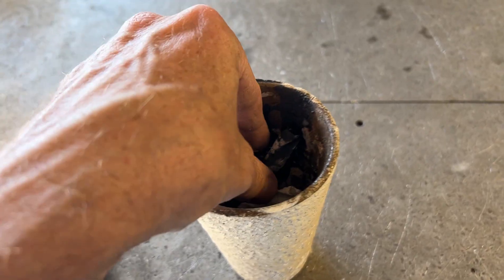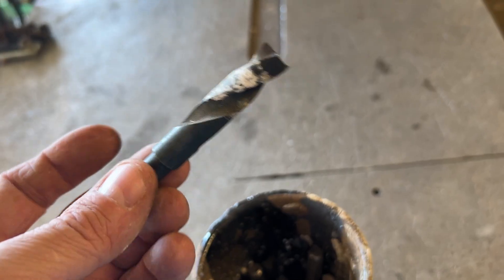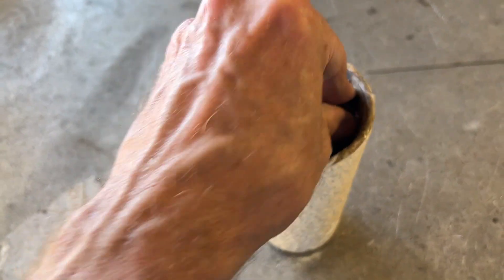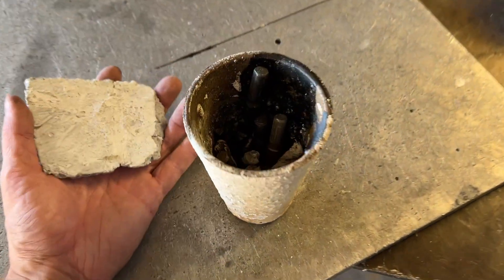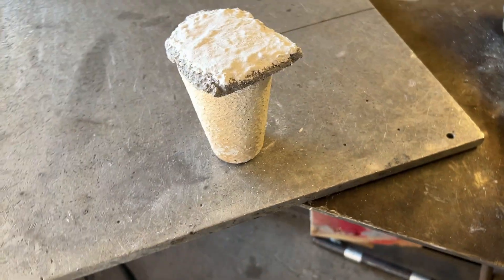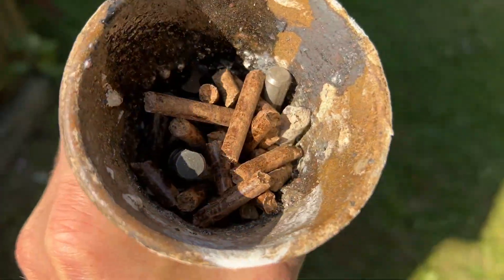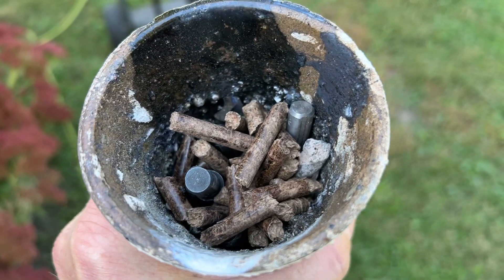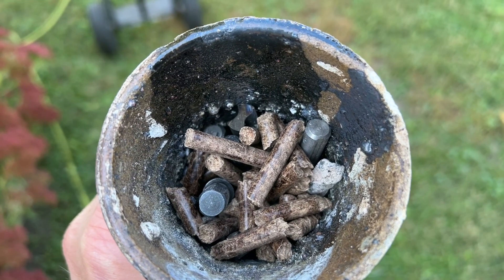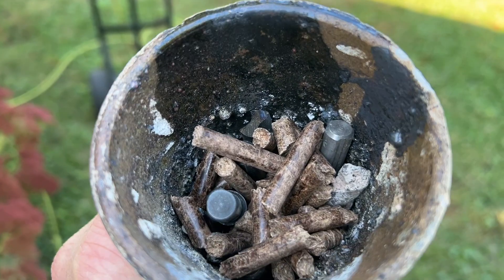Alright, we got 336 grams of some drill bits that I've cut in half, which are still hot. So if we can melt these without oxygen, we're really doing something. I'm going to put this crucible lid on top of it also. I put some wood chips in here — they're going to turn into charcoal eventually, but that's to burn up any oxygen that gets in here and any steam that gets in here. The charcoal will react with the steam and make carbon monoxide, which actually burns hotter than propane also.